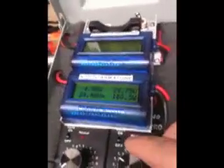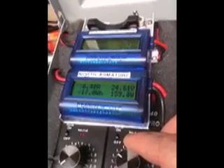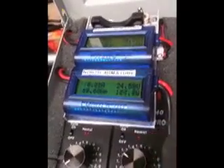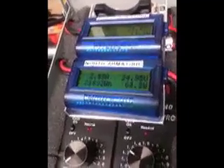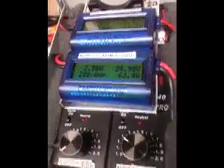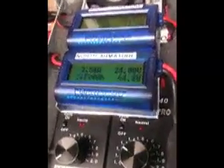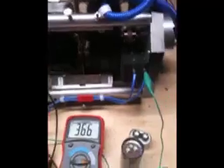Now watch this. Increase the RPM just a little bit more. It's up to about 6 amps. You hear it? You hear it unwind? Look at the amp draw — look what it's doing. I haven't touched a thing, and it decreased the speed. The amp draw on the primary mover dropped all by its lonesome to 2.5 amps. I have not touched anything, and it's making 371 volts. So at a certain point, depending on the AC to DC capacitor ratio, this thing starts motoring all by its lonesome, increases the voltage dramatically, and definitively decreases the amp draw.